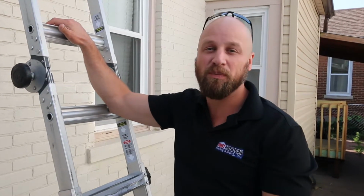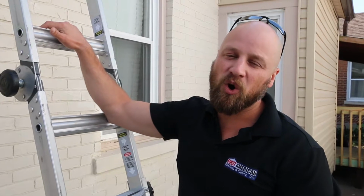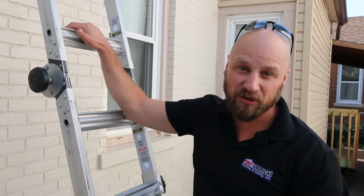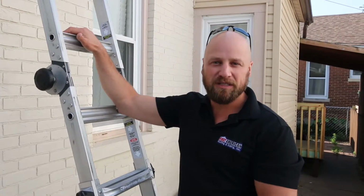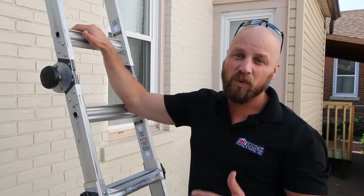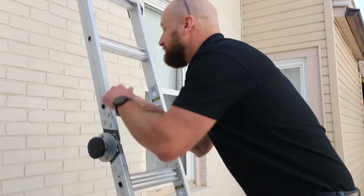It will help to a point, but the biggest benefit that you can get when you're insulating a home is to stop the air from transferring, and that's what we call air sealing. And so when we insulate your home, we're either moving the insulation, or depending on what you have in there, we have to remove the insulation, we air seal, and then we insulate. And let me show you what I'm talking about.